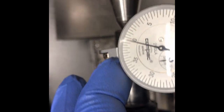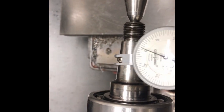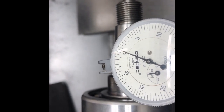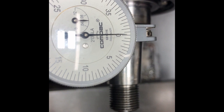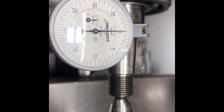I'll correct that and head back in the same direction. I took that measurement coming in the opposite direction as the first one, so I'll zero there and go back the other way. I moved it about twice as much as I should have — now half a thou in the other direction. In the end I got it down to about a tenth. I think that's probably good enough for this job, so I'm going to quit while I'm ahead.